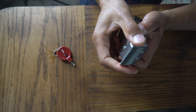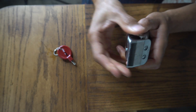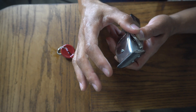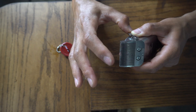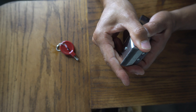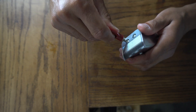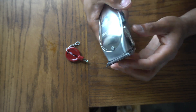A lot of people do it on a mirror, but I like to eye it — I like to put the blade all the way down as far as I can without overlapping. If you overlap the back blade, which is the moving blade, that's going to cut your client or cut you. So make sure the back blade is not overlapping the front blade, keep it nice and lined up. As soon as you get it lined up right where you want it, go ahead and tighten your screws.